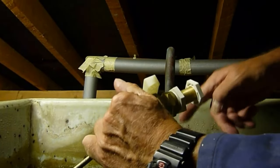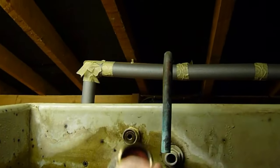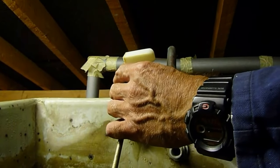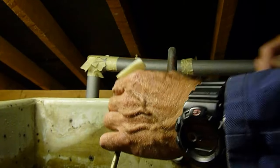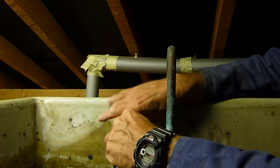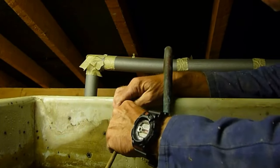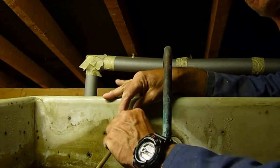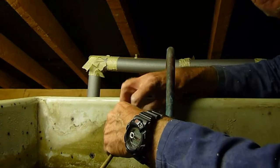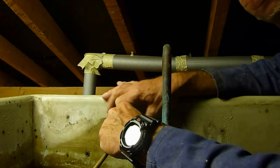With your new ball valve, split it like you've just done. Now make sure the washer's in there — that's the main thing you need to check. The spout's down; you can put the spout on afterwards if you're worried about snapping it off. Put it in there and do it up with your fingers first. It can be tricky to get a start on it but it always goes in the end. The spout can be put on afterwards — it's just a bit tight to the rim sometimes if you do it before. You can actually take the spout out if you'd rather — it might be easier.